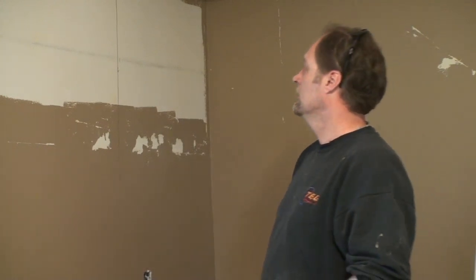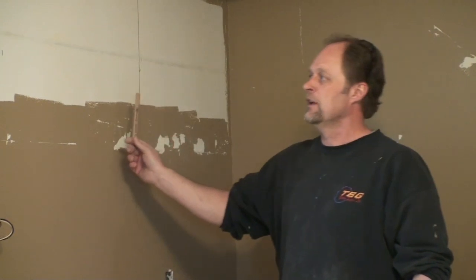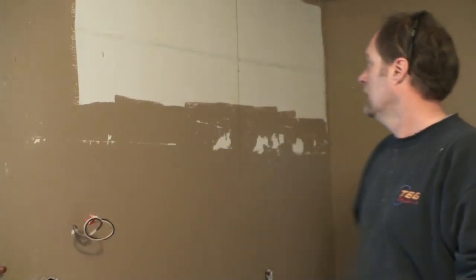We're about to start installing our cabinets today. We're going to start with our upper cabinets. And what we do is we'll measure out the length of each cabinet so that we got a reference point, and when we're all said and done, we should be within 3 inches of this window, so we can either tile it or put a nice piece of trim on it.